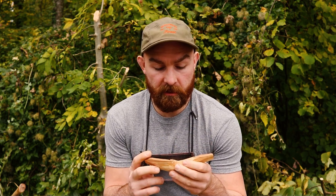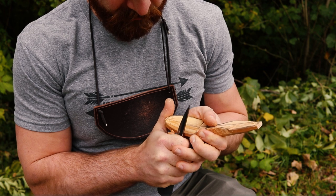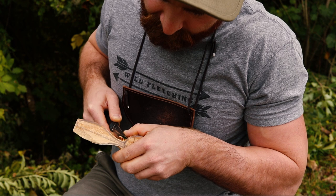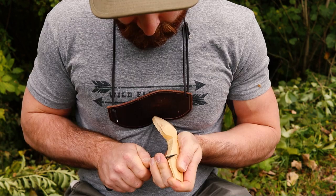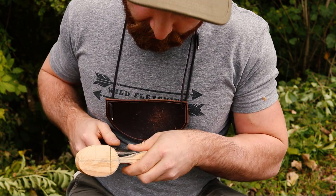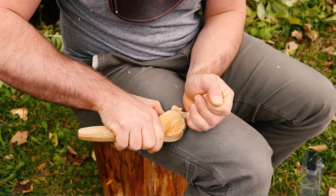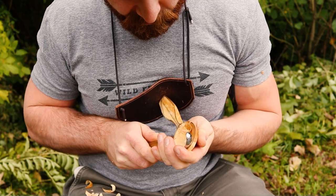Let's make our life a little bit easier — we've taken it right to the knife. We have our ax blank here. The long cuts are important because they make sure we're not getting a whole bunch of little corners that we need to round out afterwards. I'm already trying to blend with a push and a little bit of rotation, pushing with my off hand, so it's very safe. The knife doesn't go any further than my left hand is actually pushing it.